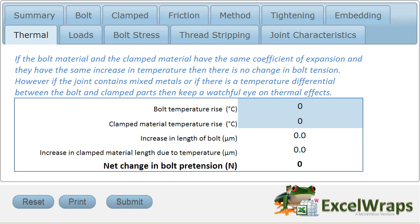the aluminium, because it has a higher rate of thermal expansion than the steel, will grow in length quicker than the bolts. So what's actually happening to the joint is that we're getting an increase in bolt tension due to that effect.